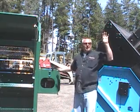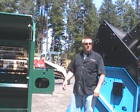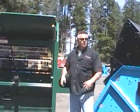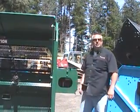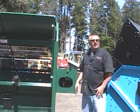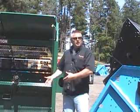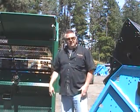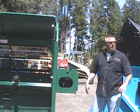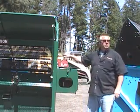We've got some wind out here today, and this was one of the reasons why we took our power plant off the side of the screener. When you're feeding this machine and it's dry out, you've got dust going everywhere. It doesn't matter whether the engine's on one end of the screener or the other — if the wind shifts and blows back across, you're faced with cleaning out your screener or turning everything around. That takes time and it's not efficient. The most efficient thing was to remove the engine, take it away from the screener, and put it remotely where you can plug it in with an extension cord. No dust over there — it doesn't matter what's happening over here.